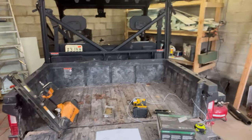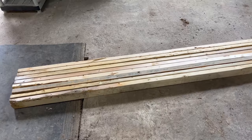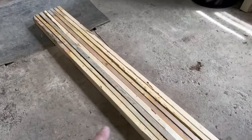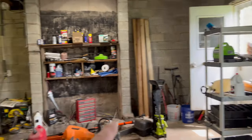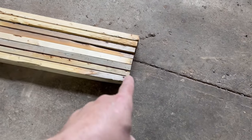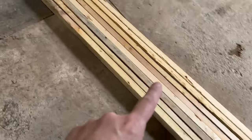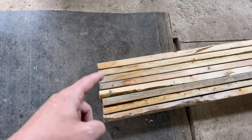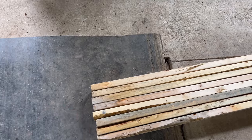I'm going to be using actual power tools and air nailers. I have some of them set up over here and the rest are on the back of the side-by-side. Now we're going to get some of the 2x4s laid out so you can see roughly what we're making. I'm trying to maximize the length — these are the 2x4s I have, with some more standing up over there. I lined them up at the bottom to find the shortest one, and I'm going to cut all the rest to match it so every piece is the same length.